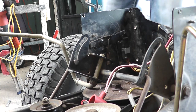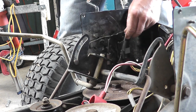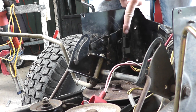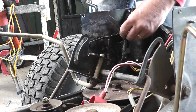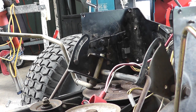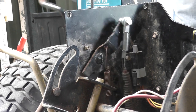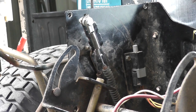Right, let me just check this theory is going to work. I'll pop a bolt through there and through that linkage. Yep, that's working a treat. Beautiful — I'll just find a longer bolt; that one's a bit short, I can't get enough on it. That's working really well. I'm really happy with that. It does pivot, it's just a bit stiff — it'll grease itself up.